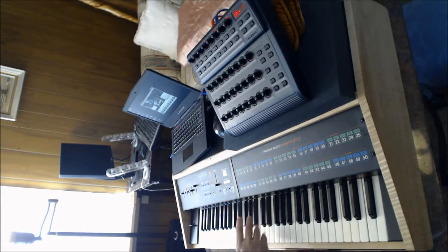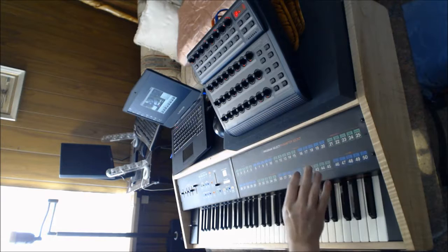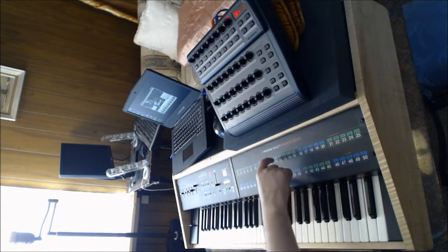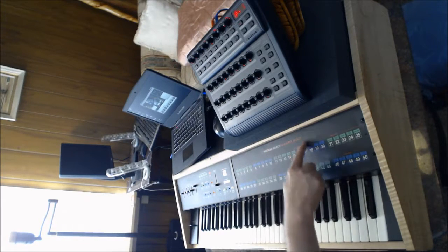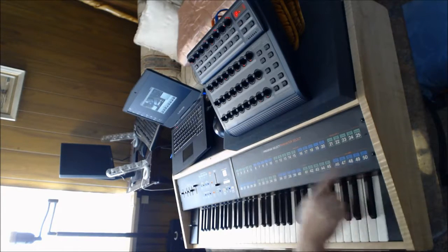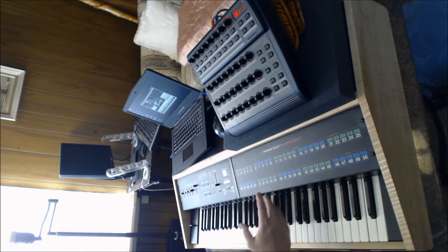So, okay. The second thing I got was the Dave Clark and company upgrade of the CPU, whoever helped design it. I immediately switched it out. I did it by myself. I took this apart, and it just unplugs the old board, which was this big, with that ribbon cable that connects the other board in here. And you just install the new one, which is tiny in size, doesn't require batteries, and it holds 3 patch banks. So there's, what would that be, 150 patches, right? It was great.